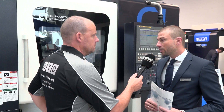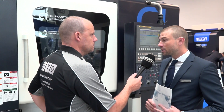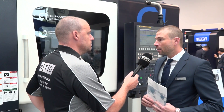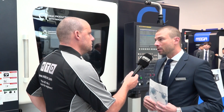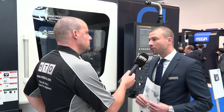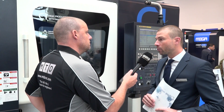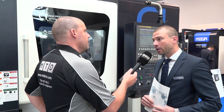On this lathe, which has a 6-inch chuck or optional 8-inch chuck, a spindle and optional sub-spindle, and with this big variety of tools, you can machine very complex parts within one clamping. You do not have to move the parts to different machines. You can run it manned or unmanned with automation — very complex parts within one clamping — which gives more productivity to customers.